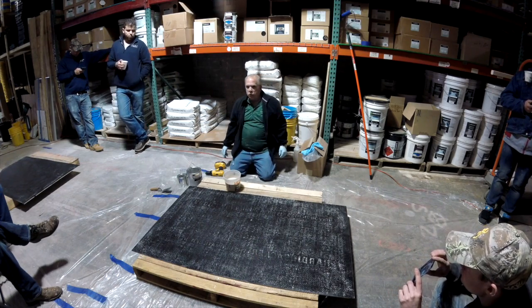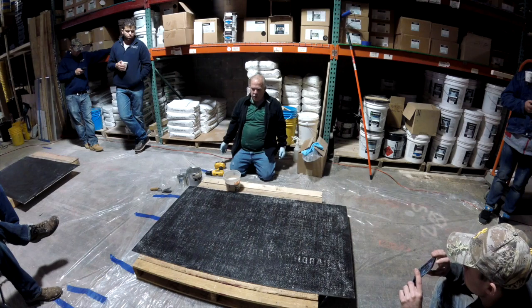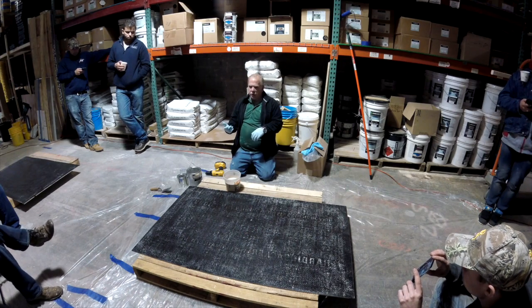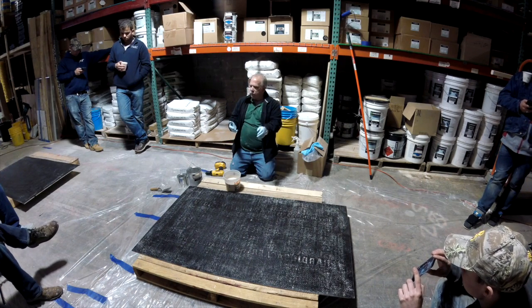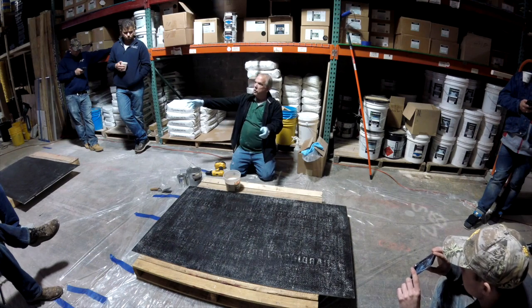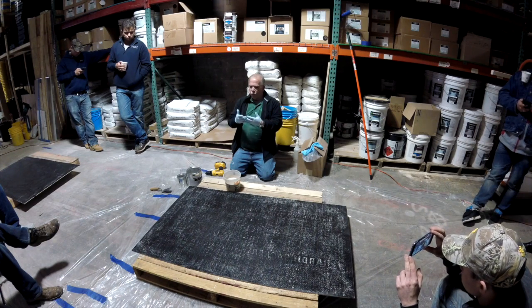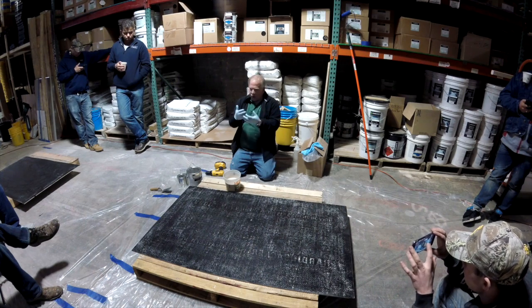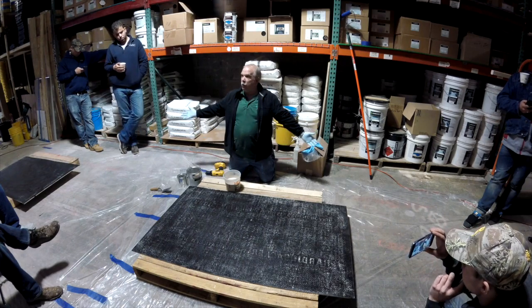Okay, with all epoxies, once you mix the epoxy, you want to get the epoxy out of the bucket. You don't want to leave it in there and put it in a paint roller and paint it out. You'll lose the epoxy. What happens is the two components are coming together and they make the one component. So when you do a water-based epoxy, once it turns into epoxy, there's no difference in structure in that epoxy between this and the solvent-based. They're both epoxies. But when those two things are coming together and they're forming the epoxy, they cause heat. And it's like you get a whole bunch of it together and it causes heat and it makes it kick that much faster. So that's why you want to get it out on the ground